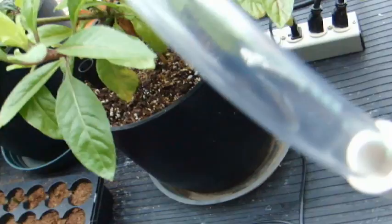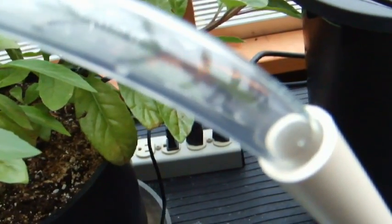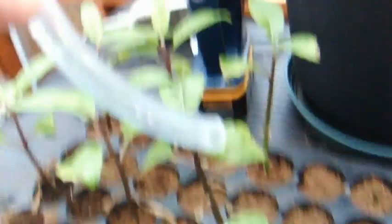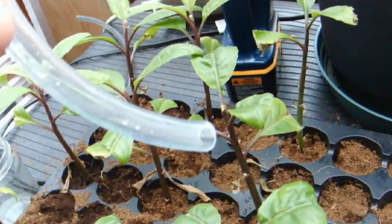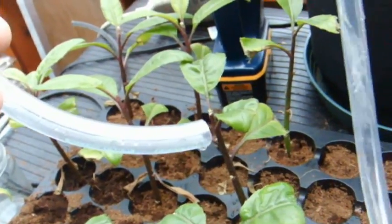We turn the air to maximum — and there it goes, already pumping water. The air comes up as a slug, travels through the tube, and out the end. You can see quite a bit of water moving through. This is eight feet of line, so if you have a reservoir eight feet away, this is going to be quite sufficient.